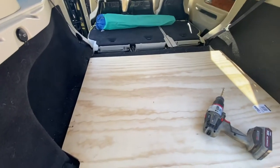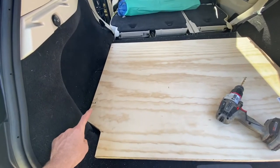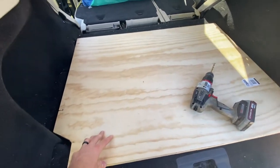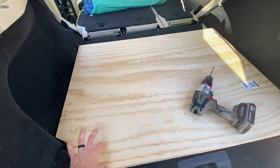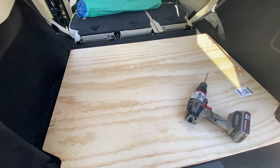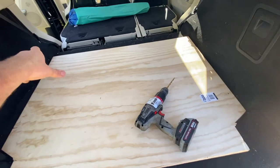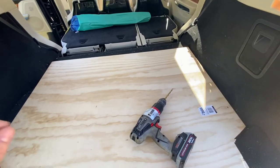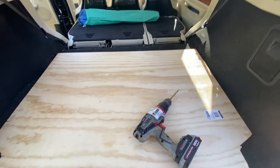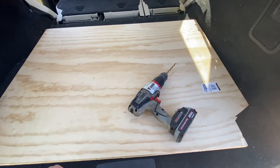I filmed with the iPhone today because I just haven't had a chance to get the actual camera out. I ran to the hardware store today and picked up the new bolts for mounting the bottom plate. The ones I ended up getting were M8 — I want to say they're inch-and-a-quarter long metric bolts. I had to do a little bit of adjustments on the holes to make sure they fit perfectly, but I just did a mock fit-up and actually fastened it down. It worked pretty good, so that is good to go.